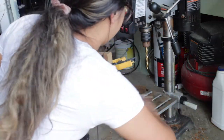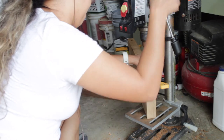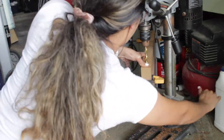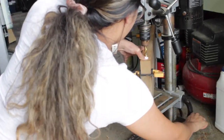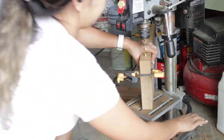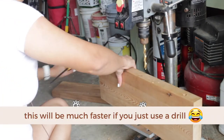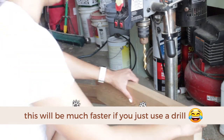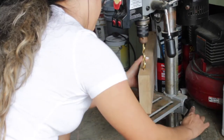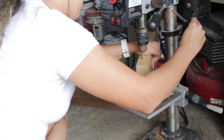They have to line up perfectly. So I struggled with this drill press and used a couple of clamps to clamp the pieces together — the back plate — so I could mark and position my drill bit at the exact same spot. If the holes don't line up you're going to have an uneven ridge, one side taller than the other. To make sure they were perfectly aligned I clamped them together, pushed the drill up, raised the bed so I could drill through the back plate and start the hole on the main shelf piece. Once I had drilled through, I would lower the thing, pull the drill bit out, do the other side, and take off the piece. I numbered them so I knew they went together because they have to align perfectly.